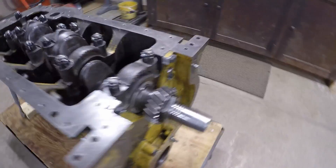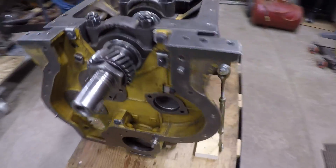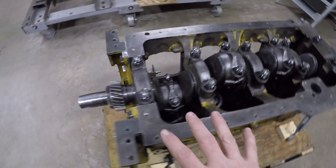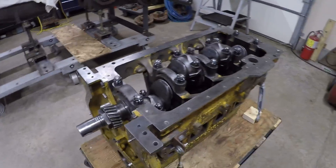We're beginning to take shape and it's starting to look a little different. We're going to move on to the camshaft next and then the rest of the timing drive components. Hopefully things should go a little bit quicker from here on out. I know we spent a lot of time on what's here up to this point, but there was a lot of work to make sure it was as right as we could possibly get it. I hope you enjoyed the episode — tune in again. Camshaft is going next. The rest of those components under the front cover from 1113 were pretty good. We've already verified cam bearing clearance in one of the prior videos — I've got a playlist for 1113 here. I decided not to replace those bearings because everything was basically at brand new spec. Tune in again, guys. I'm going to start cleaning on that cam and start throwing that in, hopefully covering some ground a lot quicker than we have been.